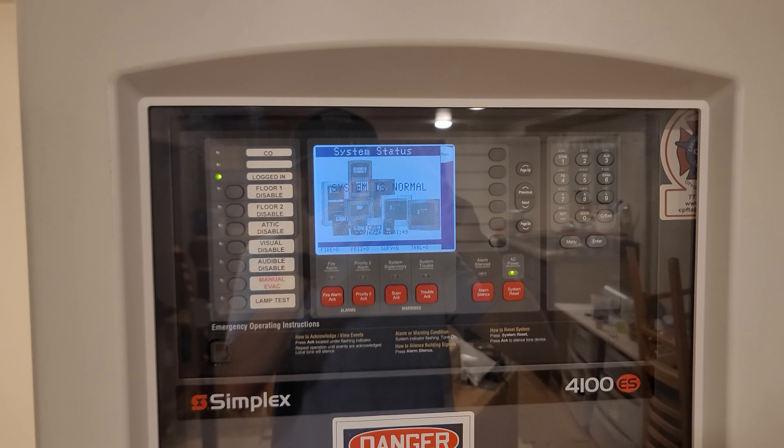To get it out of self-test, go to Menu > Diagnostics > TrueAlert Test > Trigger > Self-Test > Run Self-Test, then turn it off and accept it. Then go to View Test Results > View Last Results and it says: 'Pass — signal 909, one pass,' because that was the only device on the loop.